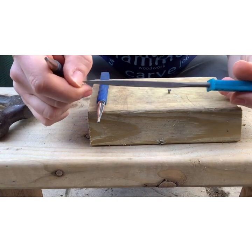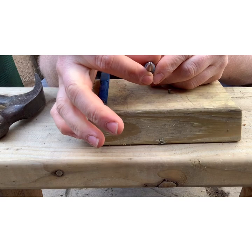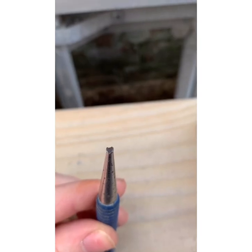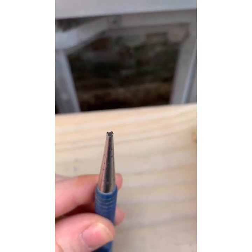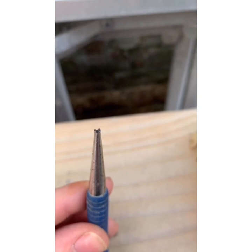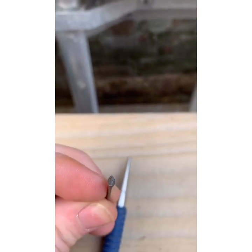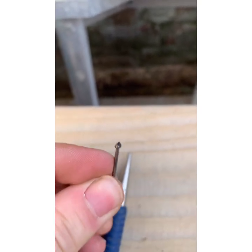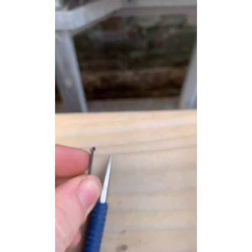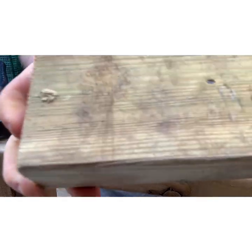What you can do — which I've done on this one — is file a profile into it. I've used a normal hand file, but you could use an angle grinder or a grinding stone to make a little notch. You can see it better here: I've added a little notch into the middle which fits the profile of the nail. So when it comes to actually punching the nail in, it sits over that little crease in the nail and punches it straight down without marking the wood.